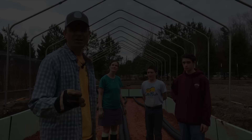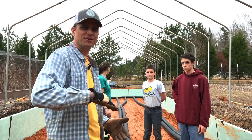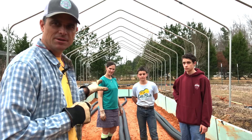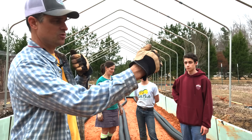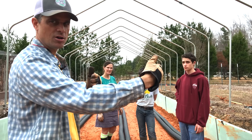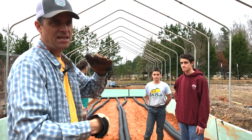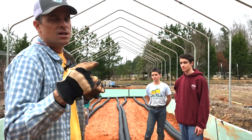It's day three on putting in this earth battery system and we got the first layer done and backfilled up to two feet. Called everybody out this morning because we have a wall of rain coming. We cut all the pipes and laid them in for the second course at two feet — same spacing between the pipes, two feet between them. In theory each pipe is heating or cooling a foot of clay all the way around it. Now it's time to start backfilling this layer and hopefully get it all done before the rain comes.